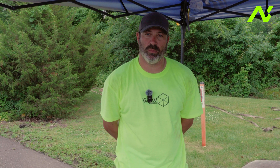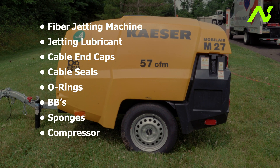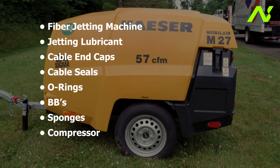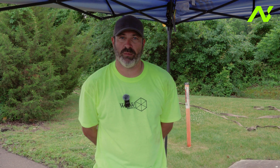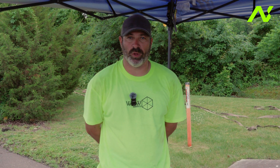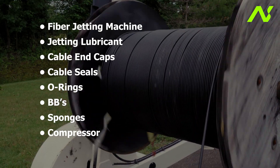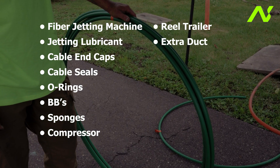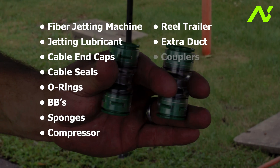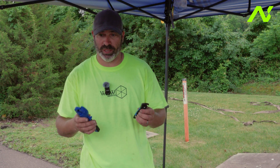Typically that's going to come whether you're renting or purchasing the equipment. You're also going to want a compressor that meets all of the recommendations per the manufacturer. In this case we're using a Kaeser M27, a 200 psi machine — you absolutely want the ability to reach 200 psi while jetting fiber. In addition, you want a reel trailer, some extra duct the size you're jetting into, some couplers, and any associated hand tools.